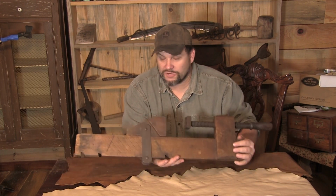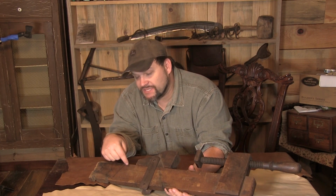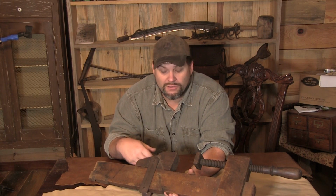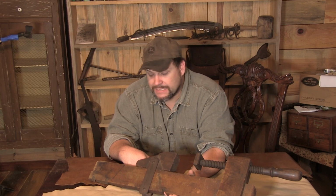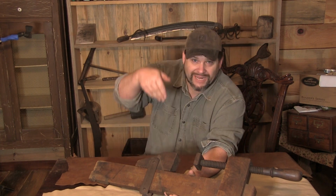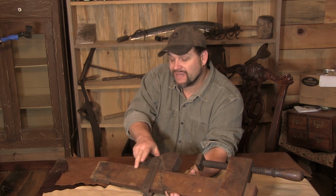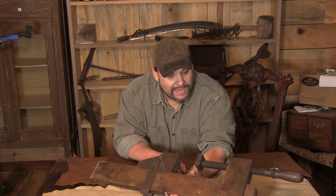You've still got a couple saw marks here on the side. And again, these saw marks in the original lumber are sometimes a very handy thing to be able to date them, because if these actually have a bit of a curve to them, that means they're from a circular saw, which really didn't come into use until industry got going. That was a Shaker invention, if I'm not mistaken. Most of the time, the original saw marks on the lumber are going to be from a sash saw, which is going to have an up and down type look. And even if it was done with what's called a pit saw, those marks are going to be very straight, and they're not going to be nearly as consistent as something like this.